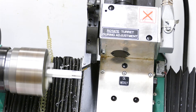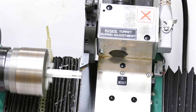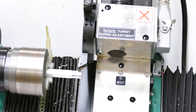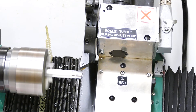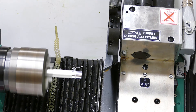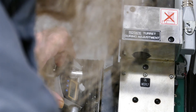There are two ways to set the X dimension. One is to take a very fine cut, measure the diameter, and enter the measured diameter into the tool table. The other is to measure the diameter and jog the tool up to the workpiece and use the measured diameter. Taking a test cut and using the position of the test cut and measuring the cut diameter is a more accurate method. Note that we don't move X after taking the test cut — we can move Z away to clear the tool path, but we must not move X as we're going to use that X position in the software. We've measured the diameter of our bar; the micrometer is probably overkill for making a mini-top, but the accuracy on the Denford is quite good so it's worth doing.